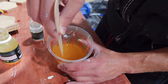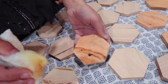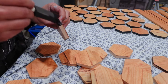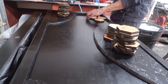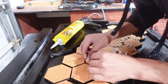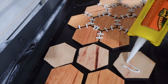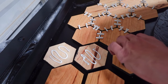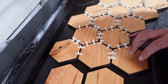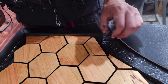After finishing all the painting, I went back and put some finish on the hexagons — using Rubio Monocoat oil, just one coat on the top surface. For the outer surfaces I painted them black since there were some burn marks. Then I laid them out on the backrest in an arrangement that looked good, keeping grains aligned and changing grain direction around the circle features — similar to tile work. To attach them, I used construction adhesive and kept the spacing equal using eighth-inch spacers, then cut off-cuts around the edges with my miter saw.